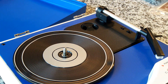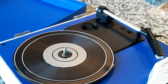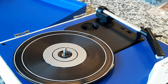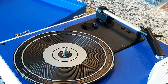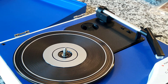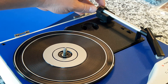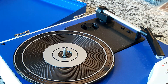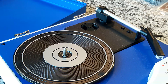Here's a quick bonus tip for those of you that have the Collegiate — I really recommend this player. You're not going to notice a one RPM difference, I guarantee you, so don't let that disturb you. Besides, yours may be spot on; another one may be 1% under. That's why there's a pitch adjust — even the C100 has variance. It's just the nature of the beast that comes with using a belt-driven mechanism. These actually have a hidden ability to adjust tracking force back here — you can rotate this metal piece in the back and increase or decrease your tracking force, if you have one of these turntables with a moving magnetic cartridge. Okay guys, hope you enjoyed it. Thanks for watching as always. Happy record hunting — we'll see you next time.